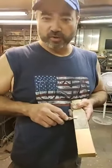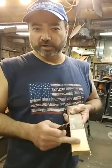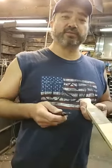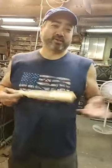And I like to saw more than anything back and forth because I think all those granules in your belt hit at different spots in your blade and they help create that burr. If you get that burr at 80 grit and you go and buff your knife, you're going to have an 80 grit cutting edge, which means it's not going to be as sharp. Get that burr at 80 and then walk it all the way down to 1200, 2000. You've got a 2000 grit burr that's going to cut finer, smoother. Seems like you don't have to pull as hard. At 80 grit, you'd have to carve a little bit with more oomph than you would at 1200. Okay. That's all I know.